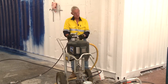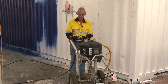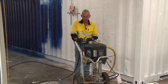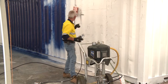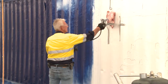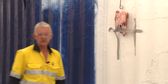I suggest you use it. The airless gun and tip we talked about before has the capacity to inject you. To give you an indication of just how powerful that is, this particular airless pump we're using today for this top coat polyurethane — which is very thin — we've put a piece of meat on the wall up here to show you how easy this is to penetrate your skin. Say for example I had it up against me, or I bumped myself and pulled the trigger — that's the sort of injection I'm talking about.